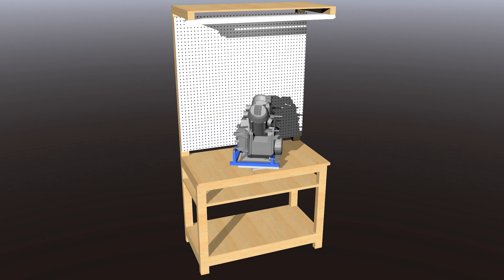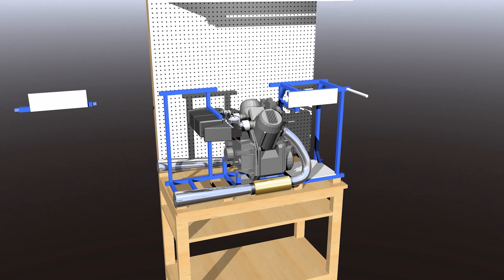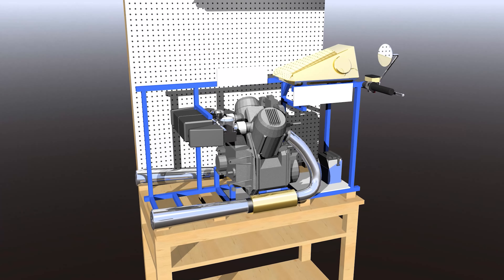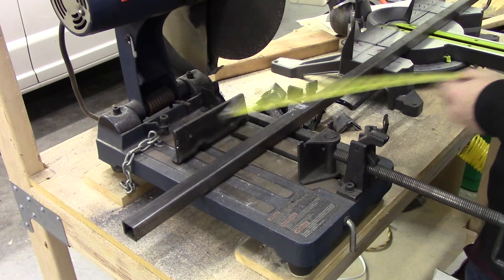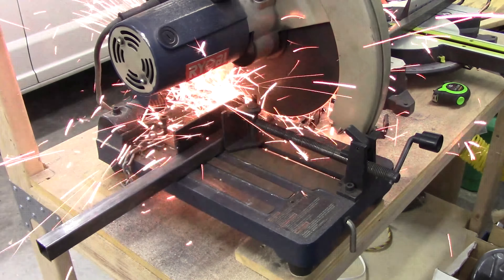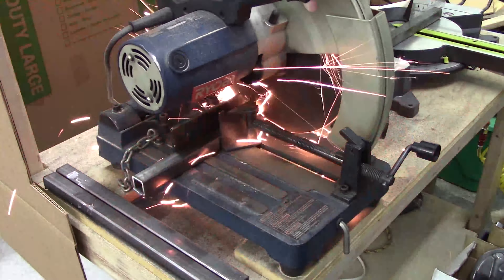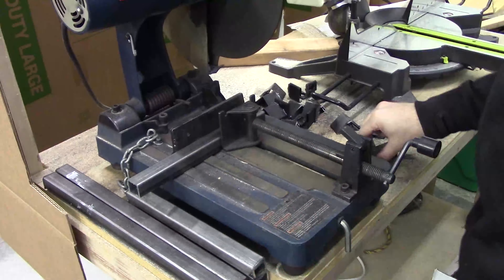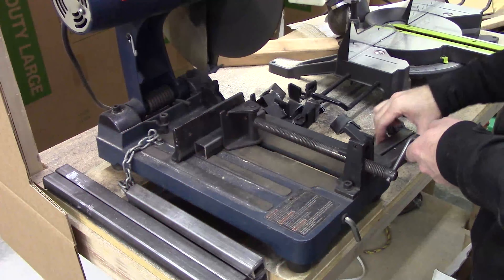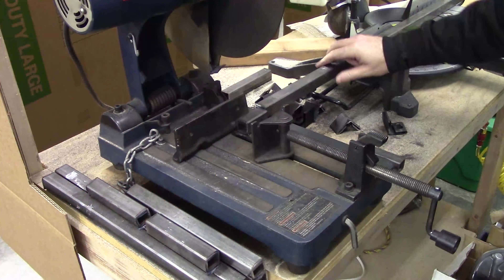I started next on an engine test stand to make rebuilding and testing this engine, along with rebuilding other CXs, much easier and more convenient. The engine test stand starts out as a simple steel square with vertical posts to the engine mounting bolts, all of it sitting on top of a heavyweight-rated Lazy Susan from McMaster-Carr. I started out by cutting the pieces for the base and vertical posts on the chop saw out of one-inch thick-wall steel square tubing.